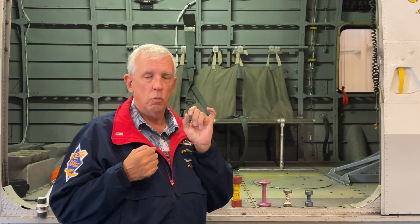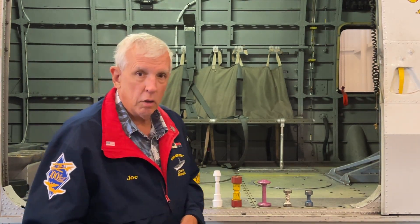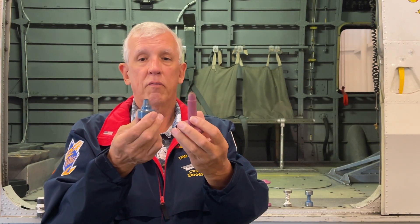Now what actually happens is when those break apart, half of that fitting will stay in the holdback on the aircraft and half of that torsion bar will stay in the holdback fitting on the flight deck. We have to take them out and throw them over the side — we're very good at polluting the oceans. This is what they look like when they're broken in half: you'll see it actually stretches before it pulls apart, that's why they taper down like that. Kind of bizarre, right? Cool.